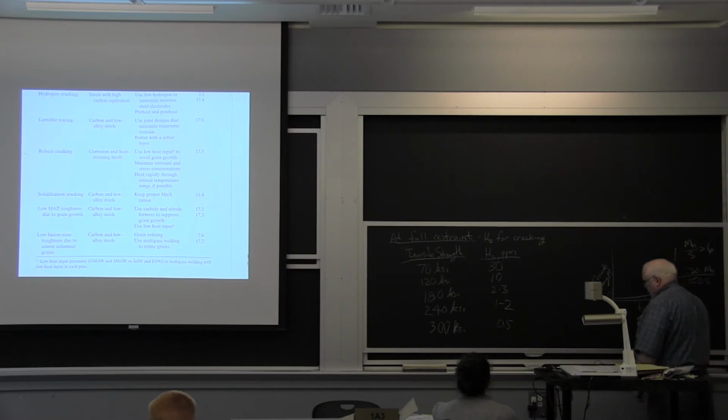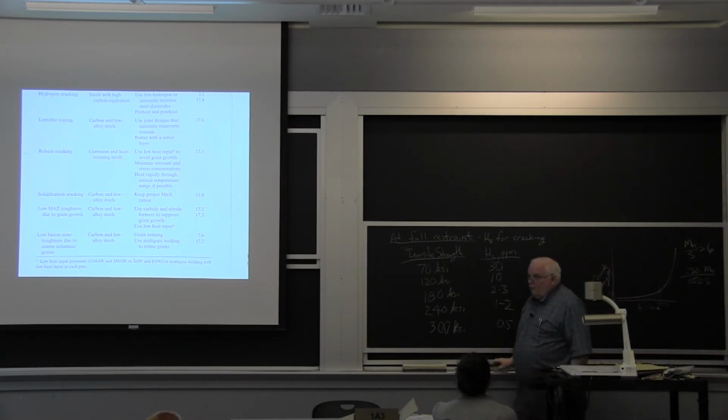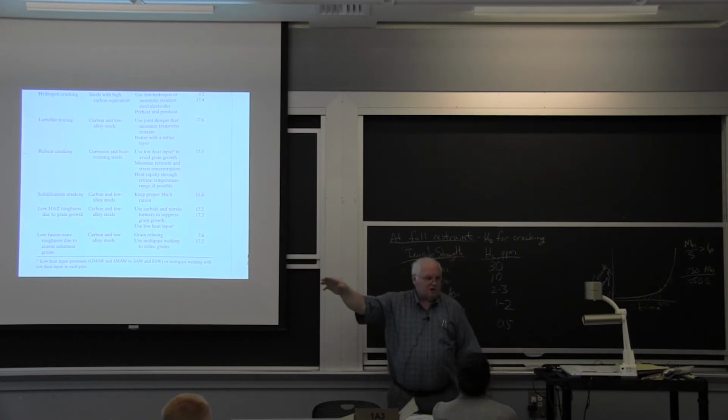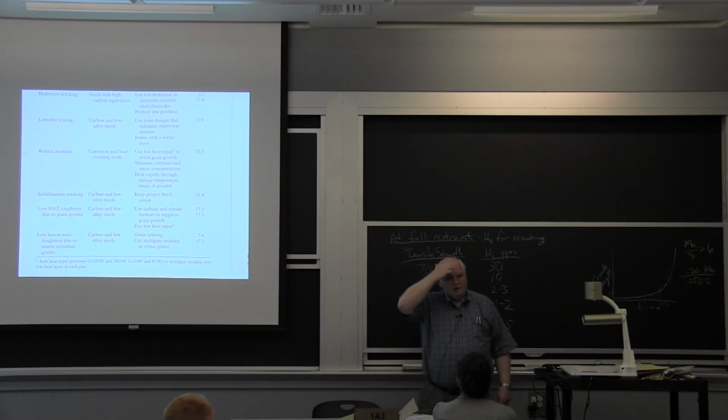And most steels have 0.3 manganese. Many of them today have 1% manganese, so it's not really a problem. Unless you're doing something like the Mass General subway stop, and they're doing that. I told you, they call me up and I say, what's the composition and stuff.